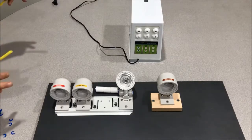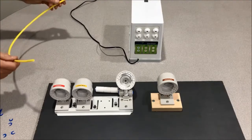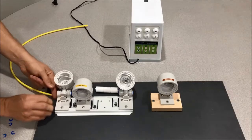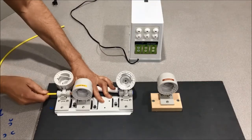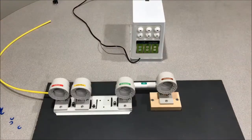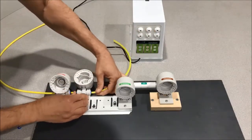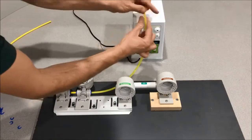Now we're ready to plumb step-by-step all the tubing to connect the Smart Buddy Booster Pump to the Twist-In system. Step one: connect your supply line — this would connect to your water source, your faucet in the house, or under your sink. Tip the sediment head up, remove the blue clip, and insert the tubing. Push the tubing in, it stops once, then push it a second time so it goes in a little further, then reinstall the blue clip. Step two: connect the supply line for water exiting the carbon head going into the top right of the Smart Buddy Booster Pump. Insert your tubing until you have a second push, install your blue clip, plumb it into that top right, and install the blue clip on that connection as well.